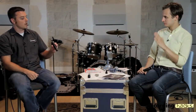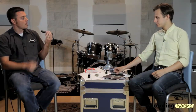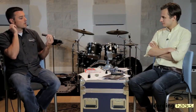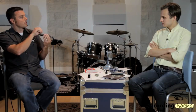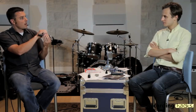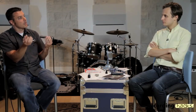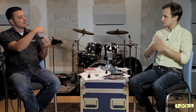As you go around the microphone to directly behind the microphone, say on a cardioid microphone, the point of most rejection is in the rear, at 180 degrees of the mic. So as sound enters, it's actually going to enter through the rear entry ports first when you're speaking behind the microphone. It gets delayed, and that delayed value is timed basically to the same amount of time it takes that sound to go around the microphone and hit the front.